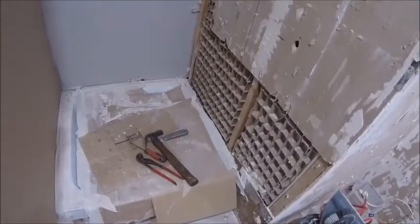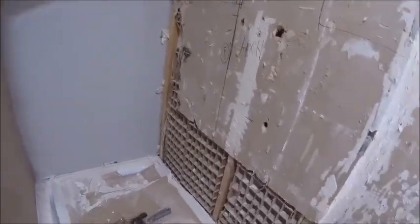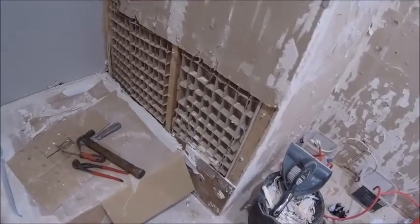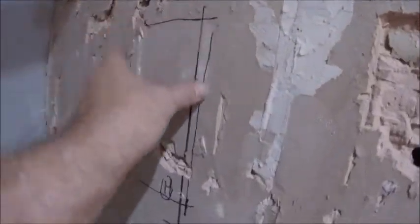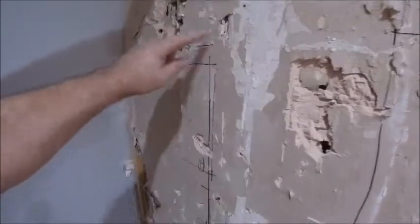The tiles are bigger than before, the shower tray is in a different position, so I've got to come up from the shower tray as much as I can. The bottom row of tiles will probably be chopped down all the way around, which is annoying, but so be it. I've got to get this wall as perfect as I can — the plate's got to be right smack bang in the middle of one big tile, then small tiles either side and half tiles underneath.